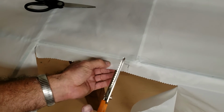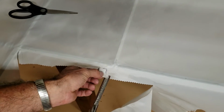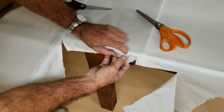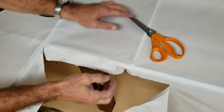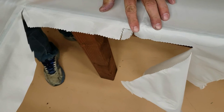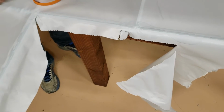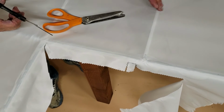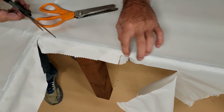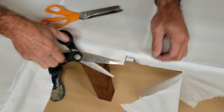What I like to do is take the pinking shears and cut that all the way up to that mark. Now then, you can glue this down and glue this down. Now this spot, you can either put the pinked edge across that, and it doesn't really matter, because when you fill it with primer and do it right, a lot of times people want to put so much paint on you don't see the tapes no more, and that's fine, but that's just more weight. It's all physics. The more paint and more product you put on, the heavier the plane's going to get. But in little areas like here, it's going to get out in there and pretty well hide itself. So you can just take a straight edge on that edge and cut that.